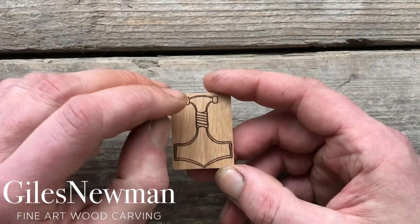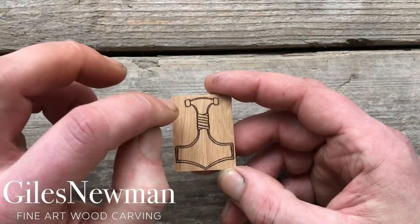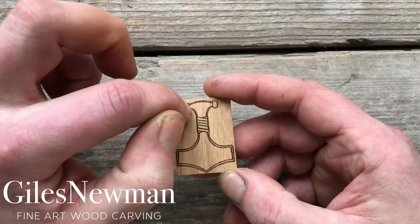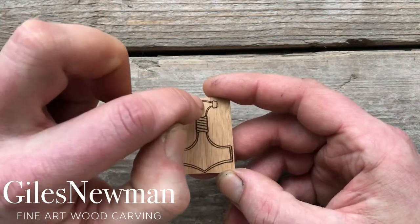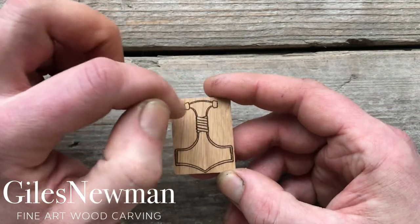Do the same up here, but not universally, because you'll want to keep these mandrels in place. To keep these in place while you shape this end of the hammer, use the tip of the knife and score along those lines, and repeat around the rope there as well. As you shave down you'll just remove thin layers of wood, but you'll leave the mandrels and the rope intact.